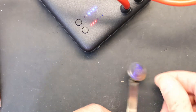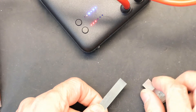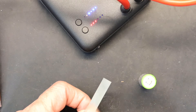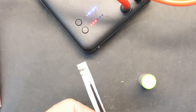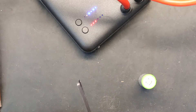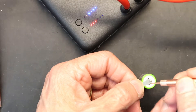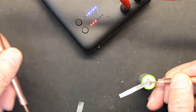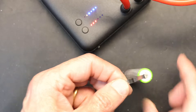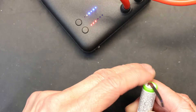If your battery is smaller, like double-A batteries, you'll need to make your nickel strips smaller. I've cut this strip in half. Now these are smaller strips for a smaller welding area. I'll place it down and weld — voila, it's welded nice and tight. You can attach multiple batteries together like that with this spot welder.